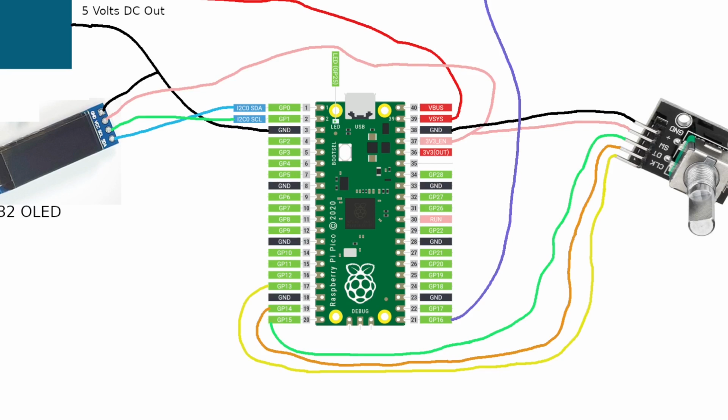Coming into the VSYS and the ground, you can use any of the grounds available on the Pi Pico. And then from there, the 3.3 volts out goes over to the rotary encoder as well as the OLED display. And then GPIO pins 0 and 1 are for the I2C. Those go over to your OLED,